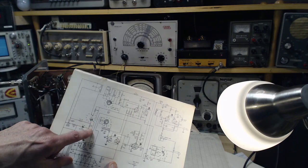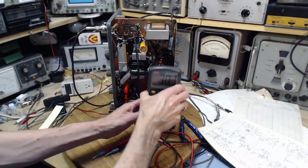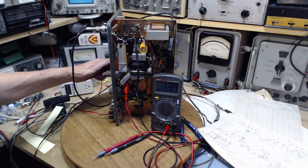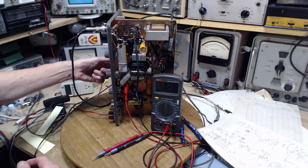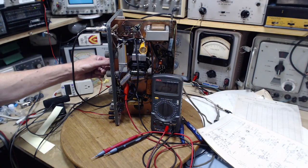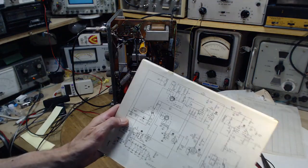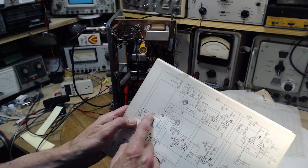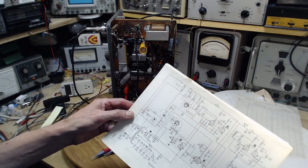Well, okay, I'm going to operate the switch. I'm going to try to knock out this resistor, and we should see a big change in the reading here. Yeah, come back down here. There we go. So I just knocked 15,000 ohms out of this circuit. Put it back. So 15 plus 12 is 27, 28, 29, 30. Okay, so what's that proving now? That's proving the switch works, the resistor's there, it goes in and out, or gets shorted out, leading this guy, and the current flow through here. So I think that's pretty positive proof that this coil is continuous.